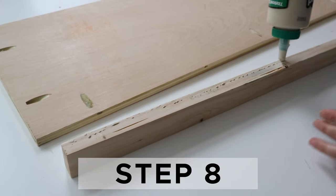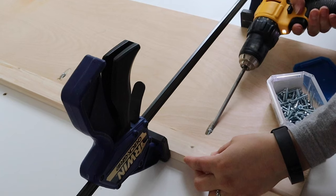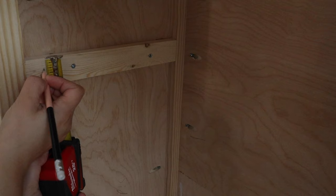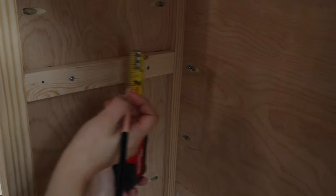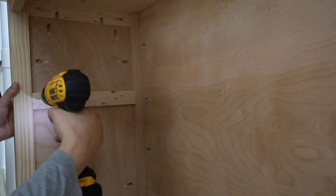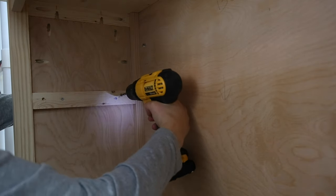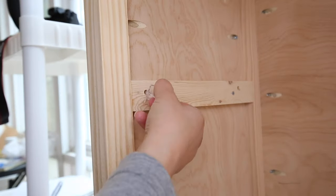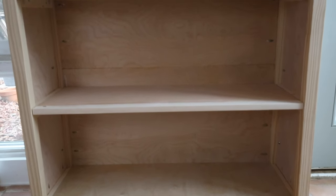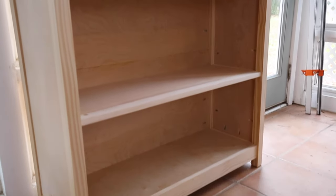Step eight is to assemble the top and middle bookshelves. Create the top and middle bookshelves by attaching a 1x2 to the plywood boards with wood glue and Kreg screws along one edge. Mark about a half inch down on the front and back of each 1x2 shelf support, then drill holes for your shelf support hardware pegs. Make sure the shelf support hardware pegs fit well in the holes. Finally, add your top and middle shelves on top of the shelf support hardware to complete the build of your DIY bookshelf.